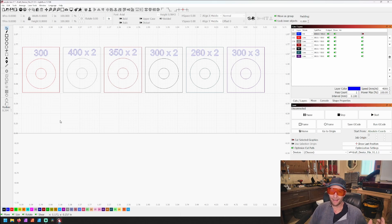There are some variations when it comes to black. When you buy your laser or see laser reviews, almost all the time with a diode laser they're going to test it on black, because black cuts the best with a diode laser and they're trying to show off their machine. But lighter colors — especially transparents — forget about it, don't even bother. I did try it again: I cut out some lime green transparent just to see. You always want to check again with the paper on. Still didn't cut through, but at least it didn't melt. In general, just stay away from transparents, whites, and lighter colors.